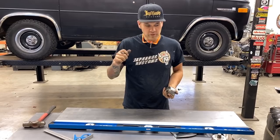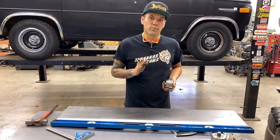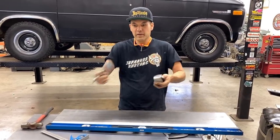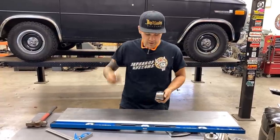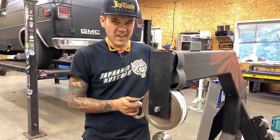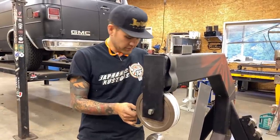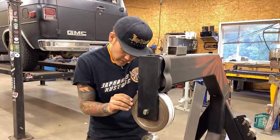We're going to get onto the wheel, put this lower anvil on, start our roll, and just keep checking the profile with our gauge as we go. You also want to make sure you're keeping it super straight, and you do want to run right off the edge of the panel — when you're using a forming scenario with the English wheel you want to go right off the edge because the edge also has to get that form in it. You might go back and forth a few times and then run it off the edge a little bit here and there to complete the profile. Christina's probably going to have to help me because it's a bit of a long panel. I've got some very thin double-sided tape that I'm going to try — this rubber band likes to walk around a little bit, so maybe this tape will help keep it from walking.